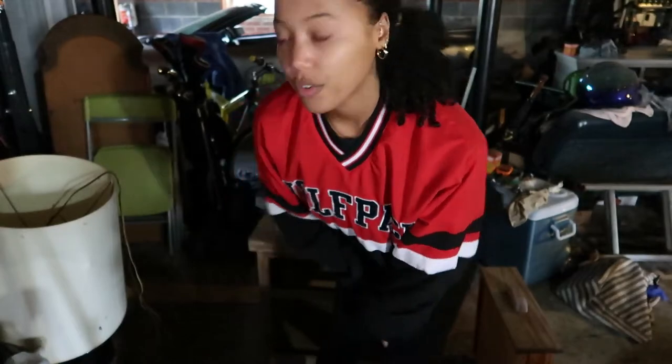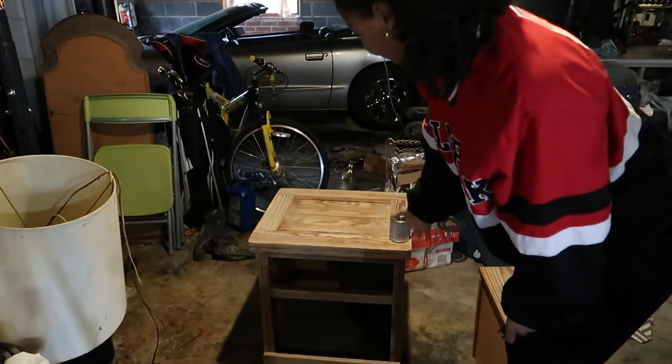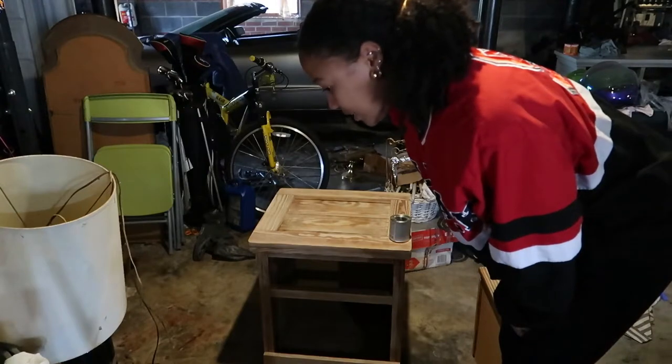Hey guys, so it is now day four — the fourth or fifth day I've been working on this nightstand. I did use the wood bleach and did about five coats of it. It didn't make that big of a difference, so I was incredibly frustrated because it took a lot of work to open each of those cans, and it just didn't really lighten the wood that much. I kept comparing it to my test strip from where I bleached it with Clorox, and the bleach was just a way better method — way lighter with just a few coats. So I decided to go back to that method and bleached the whole thing. I feel like this is as light as it's going to get and I'm frankly just sick of working on this — it's taking so much labor.